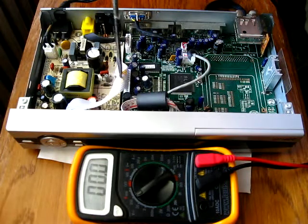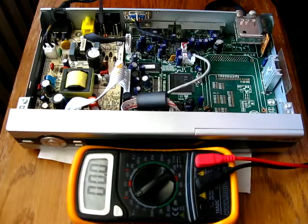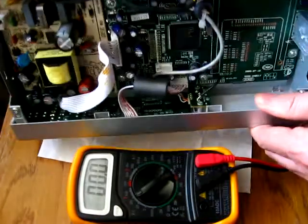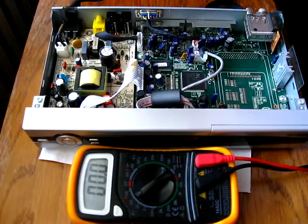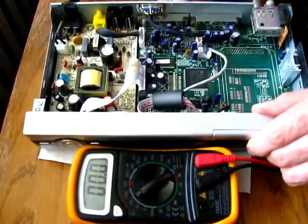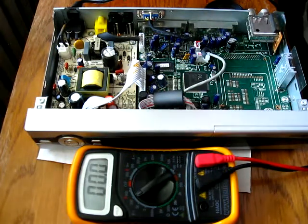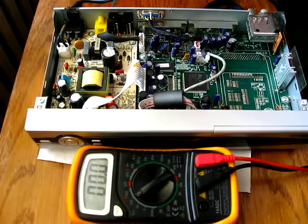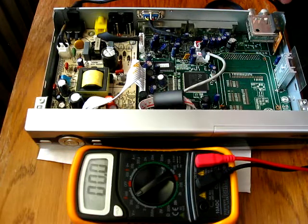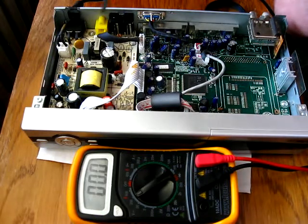And I see we have one voltage connector on this side, and here we have, separated from the high voltage or mains parts, the outputs. I think that's audio and video outputs. It's quite unusual to mount these interfaces right on the power board. Usually you would place them far away from the power board to exclude the possibility that the voltage can cross the board and appear on these terminals. Well, it's probably well separated from the mains part, but it's quite unusual to see the audio and video outputs and the mains on one board.